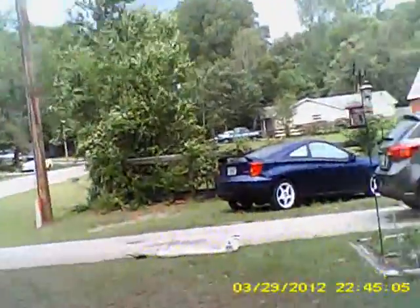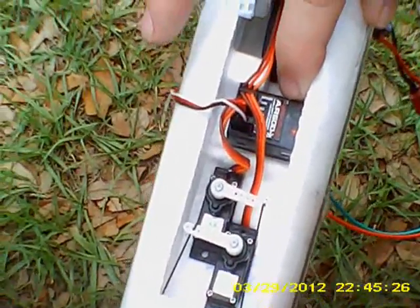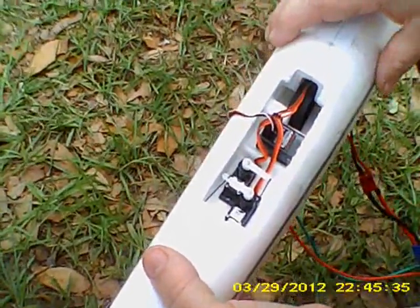I'm suspecting that we've got the receiver light flashing, indicating RF dropout. The trainer switch is on. Sure enough, the light is flashing — one, two, three. One, two, three. Three times the receiver has dropped out, meaning there's an RF problem from my transmitter.